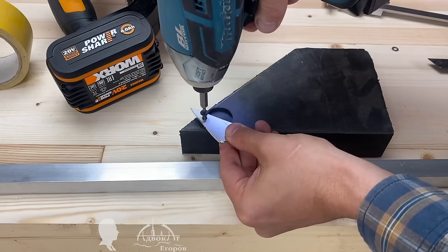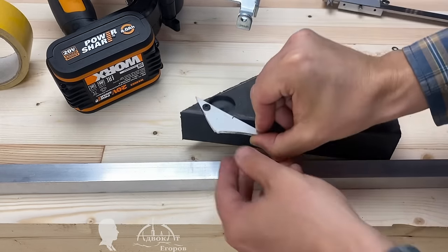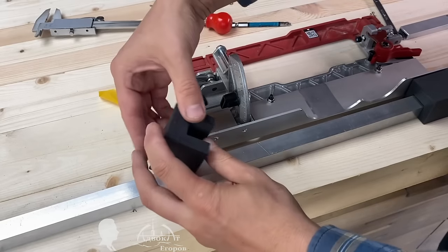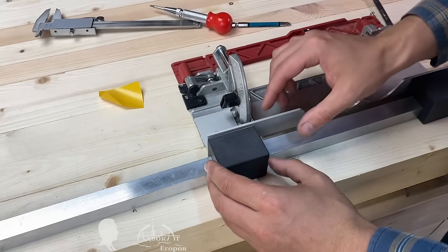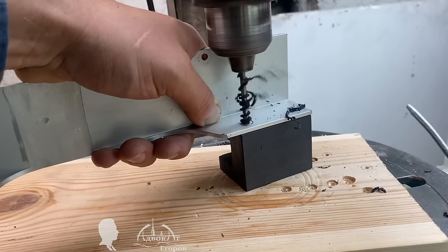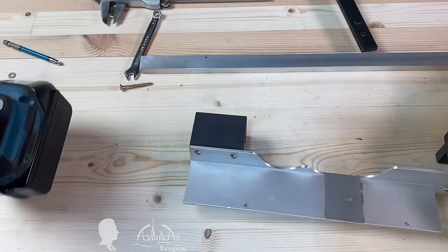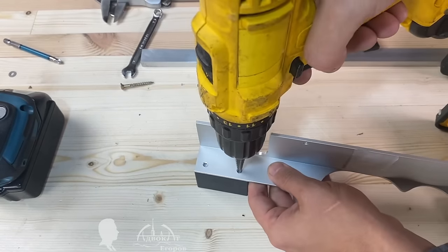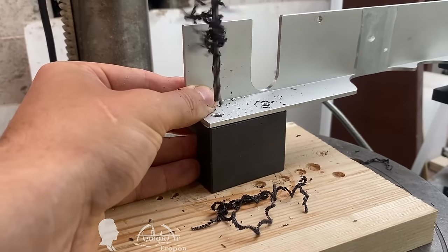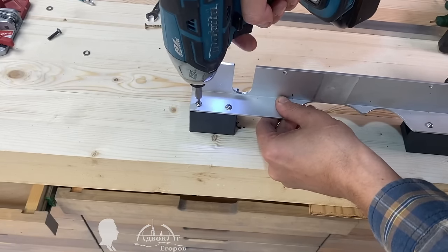It seems that it is not necessary to thread the graphite-filled caprolon. For positioning the bushings on the angle bracket relative to the rail, it is convenient to use double-sided tape. Stick the bushings in place and drill holes in the caprolon using the pre-drilled holes in the angle bracket as a template. In this case, the accuracy of the jig is guaranteed, and any misalignments and jamming of the bushings on the rail or the blade in the cut are eliminated. It is better to drill and secure the bushings with screws to the aluminum angle one by one. For added precision, I tried to spread the brackets on my miniature saw as far apart as possible.